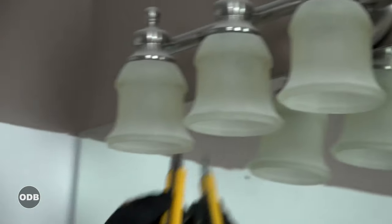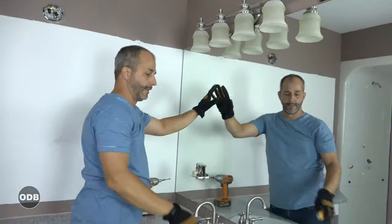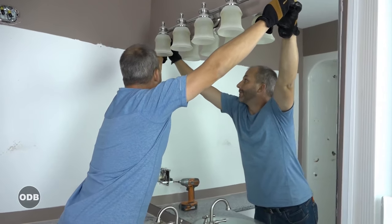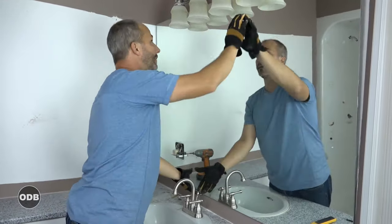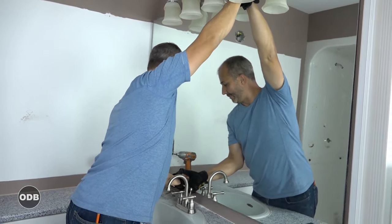This one is a moving bracket on a track, so you can take the tops off and the glass basically just falls forward. They've also used a combination of adhesives, probably because of the cut around there. The idea is you loosen the glass, then lift it and pull it off the plugs.